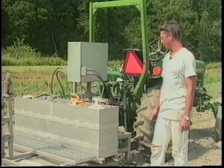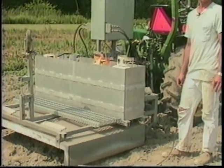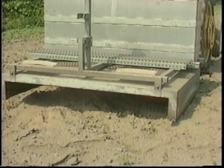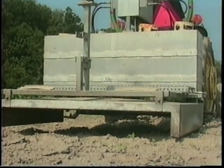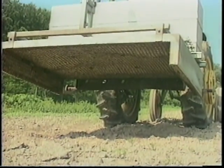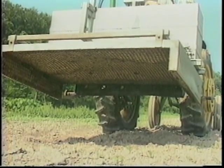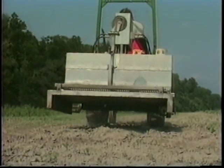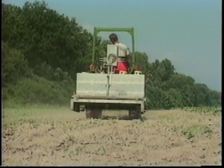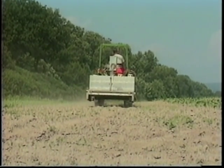In dry conditions I can travel at about six miles an hour, doing a very good job. Early in the morning, if the weeds are wet with dew, I usually shift down to about four miles per hour. The disadvantage to this machine is that it's set up for the four-foot wide bed and it's not adjustable — the burners are all attached rigidly and can't be turned off or adjusted to different angles. Since this was made, we've gone down to about a two-foot wide bed, which means we're actually only using about half of the burners. Generally this uses about $32 worth of gas per acre, which is $8 per tank to fill up. Under dry conditions we use a little less gas because we're traveling faster; in wet conditions a little more because we travel slower.